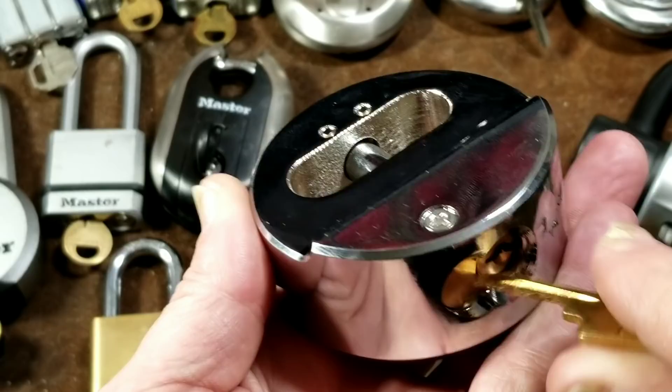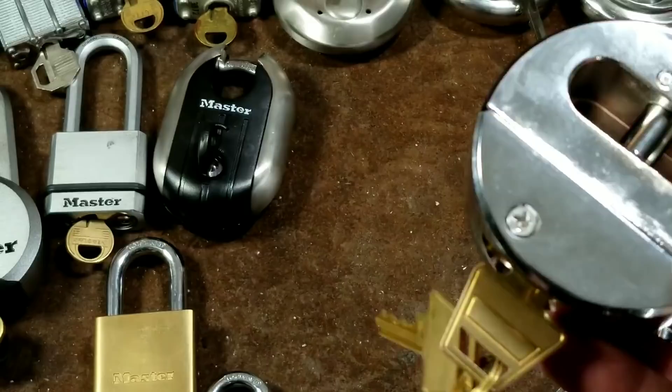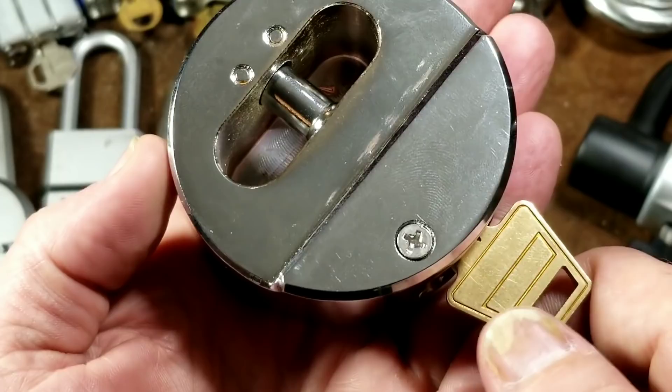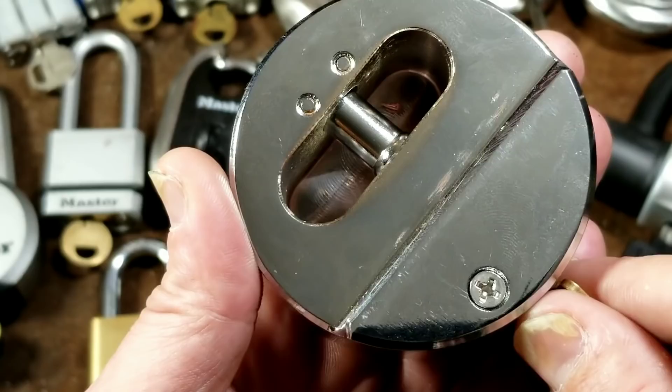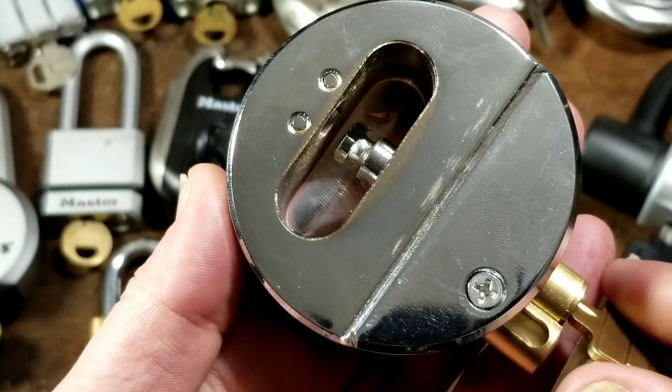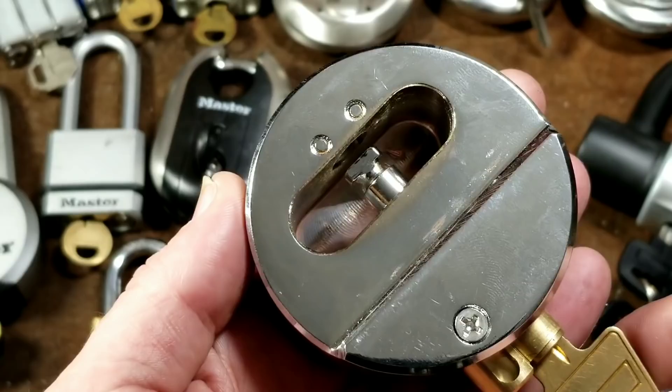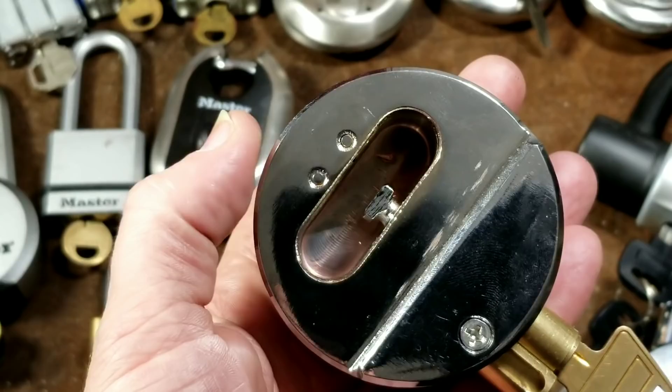As far as how these work, they have a nice six-pin core which is a really good start. This is a knockoff of an American puck cell lock, even down to the trapezoidal key, although the keyway isn't the same and the keys won't fit into each other's locks. This keyway is actually just much less aggressive than what the American uses. You put in the key and rotate it — the bolt is attached to the core, and on the end of the bolt there's an undercut and two flats. The lock body has two extra-hard steel pins, so when you push the bolt in and twist, those two little wings lock in between those metal pins.